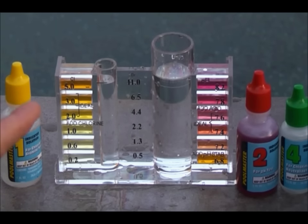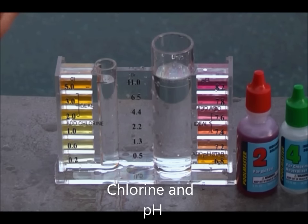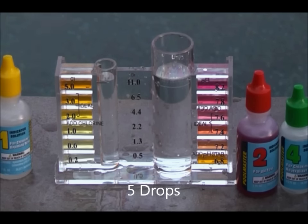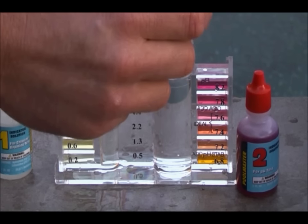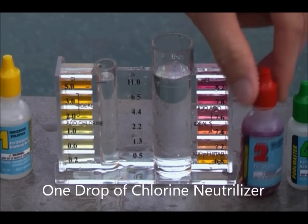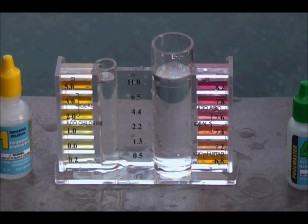For the small test vial, we're testing the chlorine. All you need to do is simply add five drops into the little vial. To save time, I like to also add the pH drops as well. First thing you want to do to the pH vial is add number four, which is the chlorine neutralizer. Sometimes the chlorine can be too high and will affect your pH test, so you always want to neutralize the chlorine in your pH test, otherwise you could get funky readings.